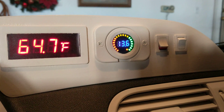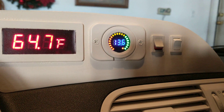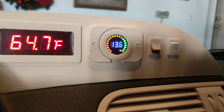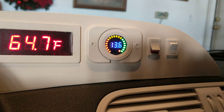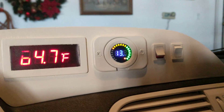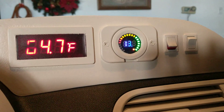The resting voltage is 13.6V. The AGMs are at 12.9V and they drained the lipos. I'm assuming this will fall, but it should still be above the 13-volt range during normal day use — probably around 13.3V. This does show that the lipos rest at a much higher voltage than AGMs.